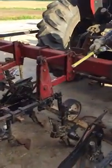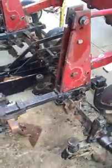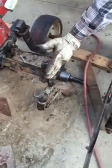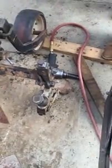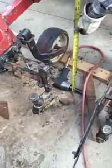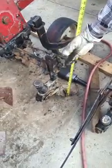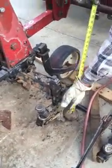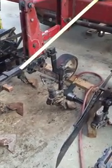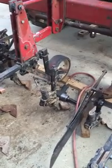I'm trying to think. You talked about angling fenders. If you notice here, there are some of the bolts sticking out. That's so that this angles, the front of the fenders will be wide, funneling the crop in, and also there will be less plugging between this shank and the fender that hangs on here if this is angled over a little bit, creating an effect that limits how much organic matter has to go through there.